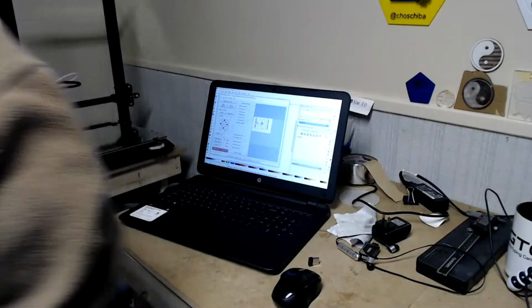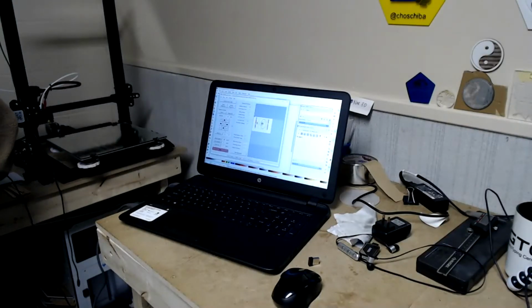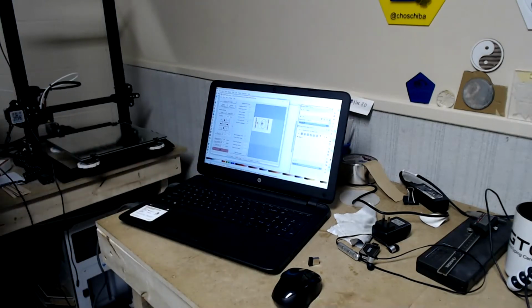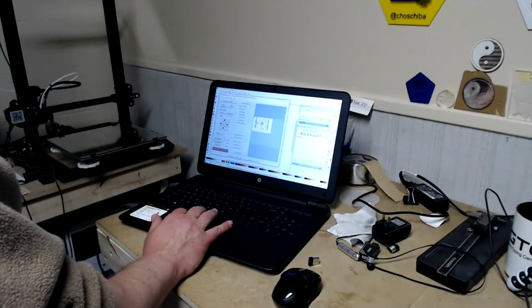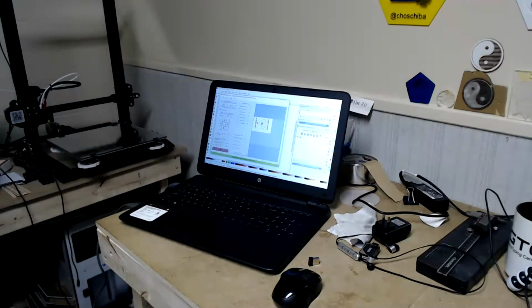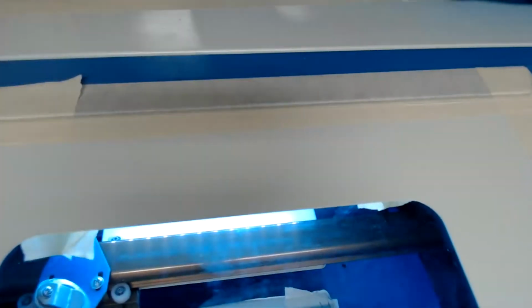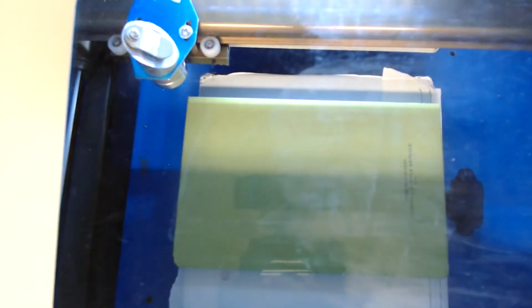All right. We're doing this. 300 millimeters per second. Power switch is on. We are at half of the power that we were doing with the wood. We're going to bring that down just a tiny bit more because that's almost cardboard. And we are going to go with raster engrave. So, if you guys want to see me mess up, this is a good time, because I've got to do some live adjustments just in case. So let's bring this down. Okay. Now you can see it. I'll fire my laser. That's right.